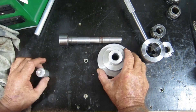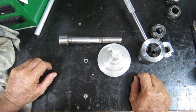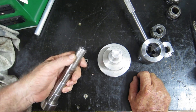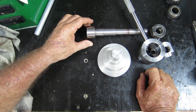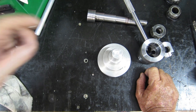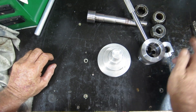So the option is to set this back up in the lathe and turn it down a bit so that it will clear this, bore this out, press that in there - there's a piece I've got lying around - press it in, then rebore it again to suit whatever size I turn this down to. I could get down to 18 but that wouldn't leave much of a wall. Anyway, that's created what a machinist would call a side project. While I've got it all apart I'll take the opportunity to clean these up and re-grease them.